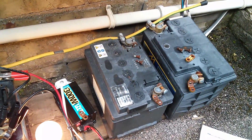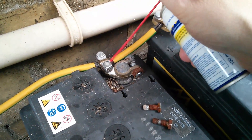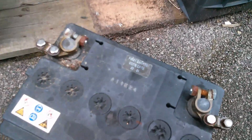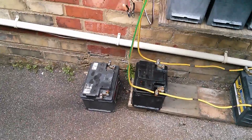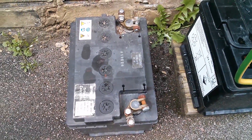The middle one is definitely no good — that's going to come out. A bit of WD-40 on the bolts because they're a bit corroded, and then I'll take that one out of circuit. Once removed, I noticed a label on it that says 'first charge code date 4901' — I'm assuming that means week 49 of 2001, which is 13 years ago. So it's not surprising this battery has had it if it really is 13 years old. The bottom two batteries are known to be good. I'll test the top three at some point. I'll remove the battery wire clips for future use and take that one down to the tip.